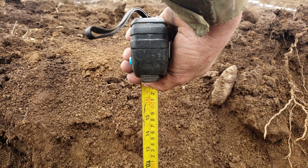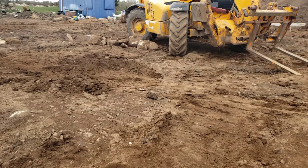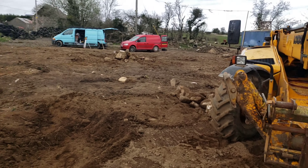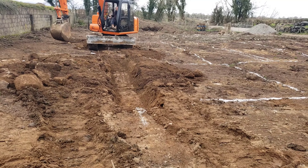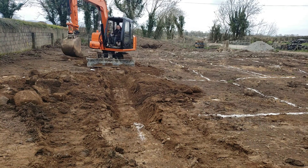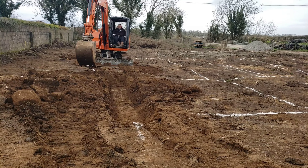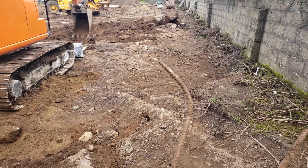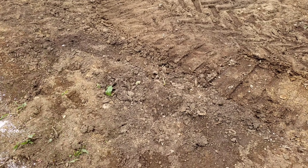As you can see here, we only have about 450 millimeters from the bottom of our foundation to the top ground level. That means we're gonna have to make the ground up about nine inches, which is about perfect for your path height. By the time you stone up and soil up, your foundation is 450 millimeters below the ground. It's not often you get this lucky — it's worked out very nicely, less digging, less everything. Super happy days.